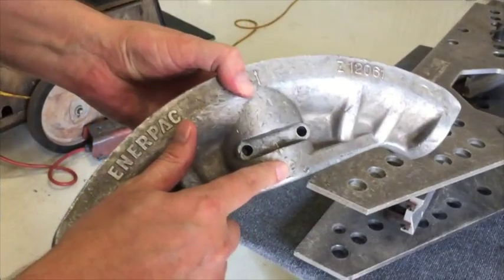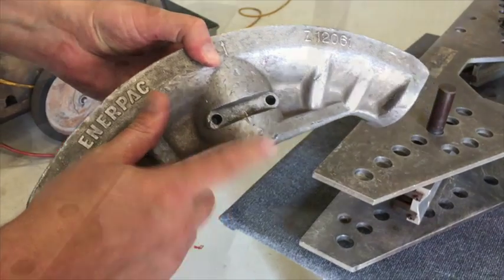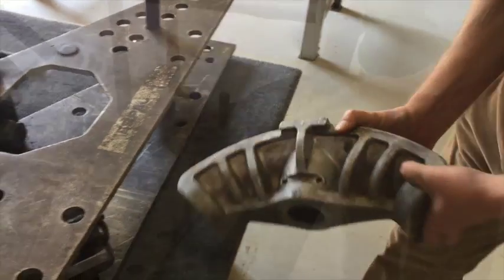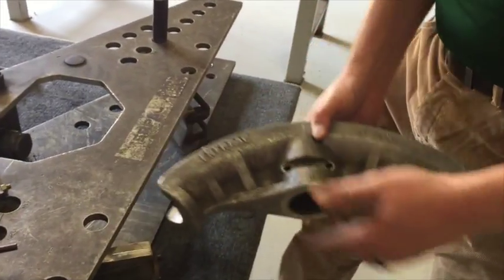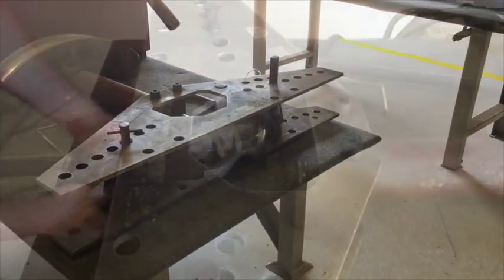The first shoe that will be used is a two inch shoe for galvanized conduit. The second shoe will be the next larger trade size, two and a half inch, and the third shoe is a two inch shoe that has been machined out approximately six one-hundredths of an inch. Through this example you will clearly see the importance of using the correct shoe.